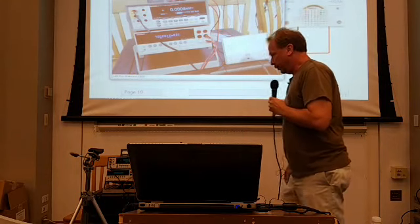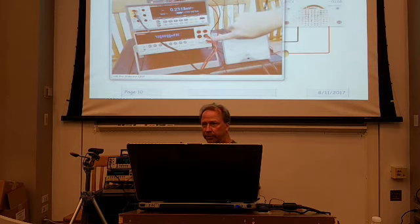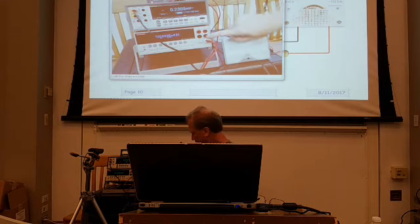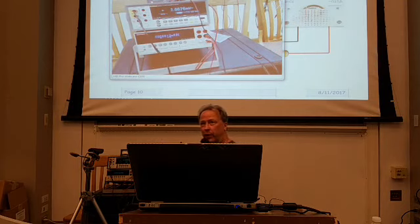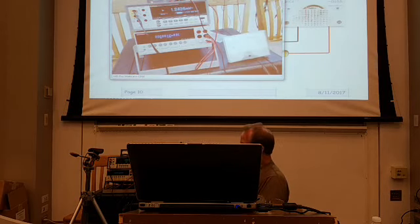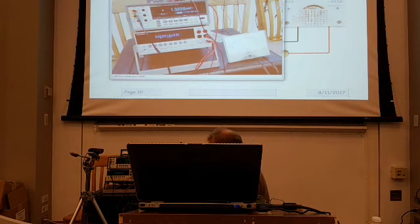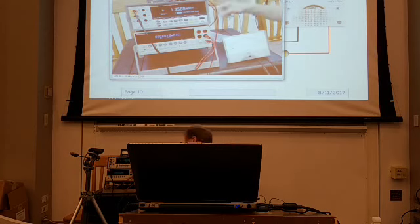So there's my setup. Remember we talked about how we're going to come out of my power supply here. The positive lead of the power supply is going into the ammeter, that's the meter down on the bottom here. We're coming out of the ammeter and going to one end of a 100K resistor. The other end of the 100K resistor is going to the positive terminal on the meter. The negative terminal of the meter returns back to the negative of the power supply.